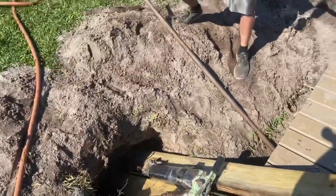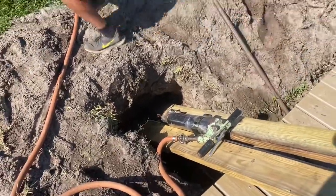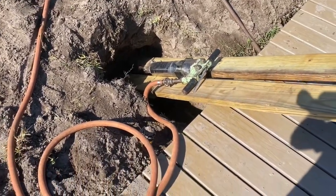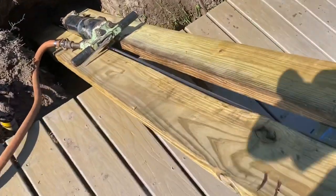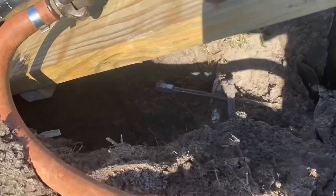Then we get down that part and we take another 5 foot extension rod, take that off and tie it into that one. Then drive it down another 5 to 6 foot, and then we'll take the end of the threaded rod going down right here and we'll couple it to the other rod, the existing rod — starting to kind of see the wall right there.